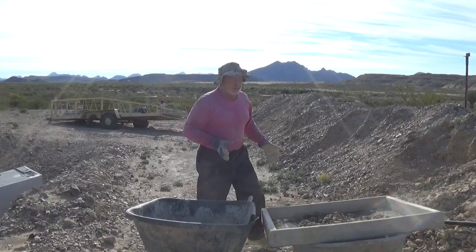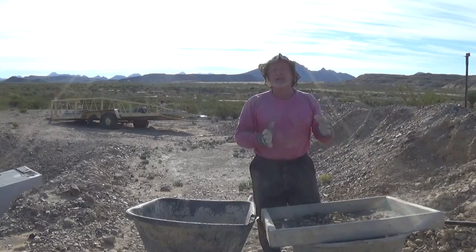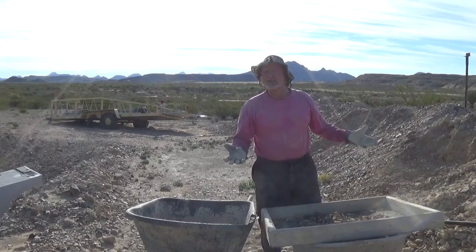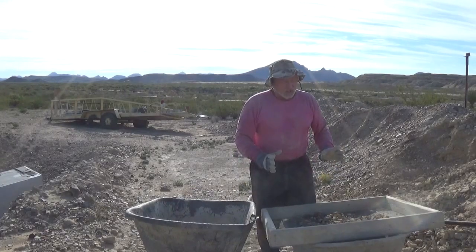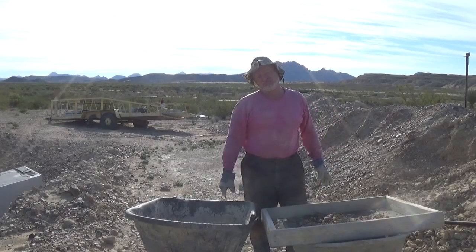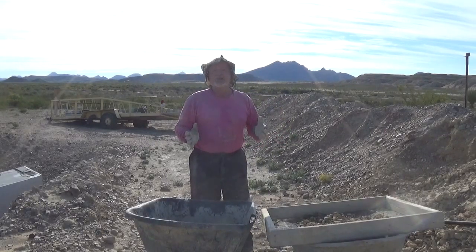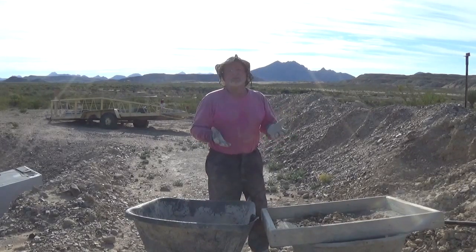If you buy ready-mix cement in a bag, you need roughly one cubic yard for a DIY project — that's about 16 bags, 16 times five bucks. It gets pricey. But that little bit of Portland probably cost me 75 cents, because I buy Portland cement in a 92.5-pound bag. That costs me $9.95 to 11 dollars locally — say 10 bucks. It costs me $10 for 92 pounds. That's a lot cheaper, and all I have to do is mix my own.